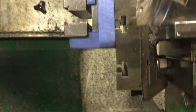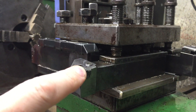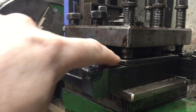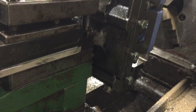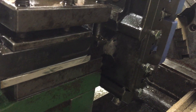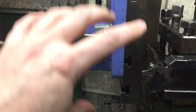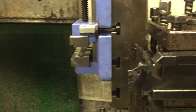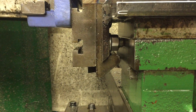The idea is that the tools work. Here's your tool — there's the tip, that's the load on it. The tip here is very, very close to the screws. The vise is sort of hanging down in fresh air below the tool post holder, and when you come around here we've got several inches of leverage. There's no way that tool block would hold it on its own, so these bolts down the back are slightly loaded and they're basically keeping the whole thing tight.